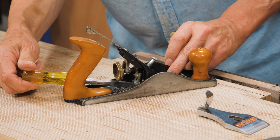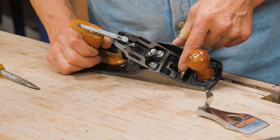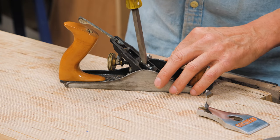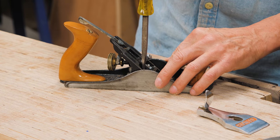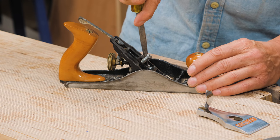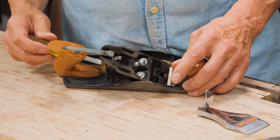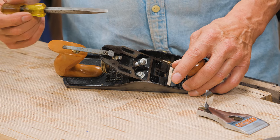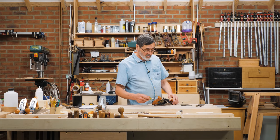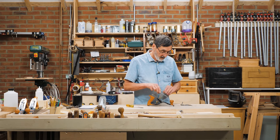The sole of the plane is where I like to align the frog to. If I align the sole somewhere around there, I can finally adjust the frog when I want to. If you cinch these two semi-tight — not super tight, just semi-tight — you can still adjust this screw. When the whole assembly is together, you'll still be able to adjust this screw and it won't shake around inside the plane. So the whole cutting iron assembly goes on here.